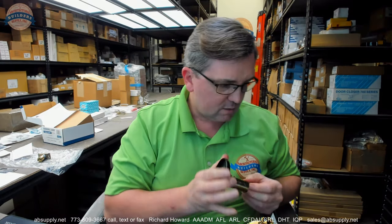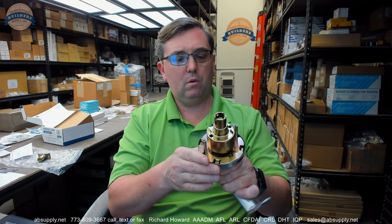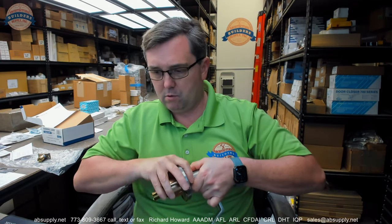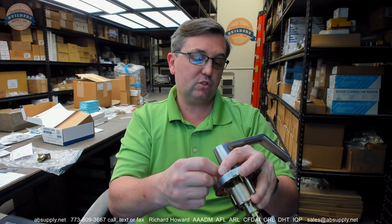Having not necessarily a rubber mallet but a rawhide mallet is a nice tool to have when you are working on locks. There we go — now the rose is off. That is our inside rose assembly. You will need to get to that. Then you are going to have the inside mounting plate right here. Out of curiosity let us go a little bit further — that is not going to come off because there is no provision for it to come off that I can see, nor is there any aspect of the installation instructions that will permit it.